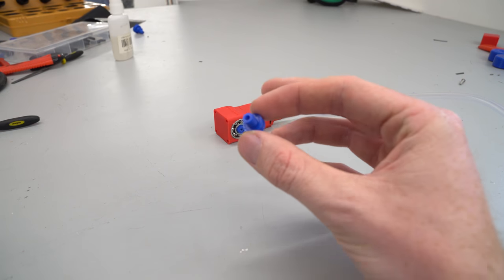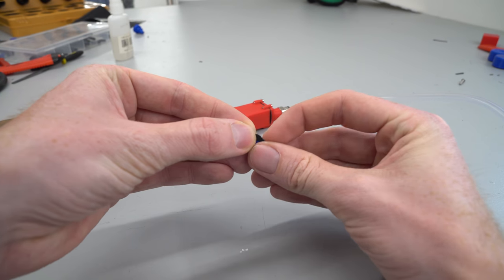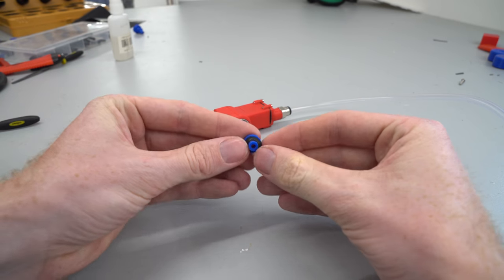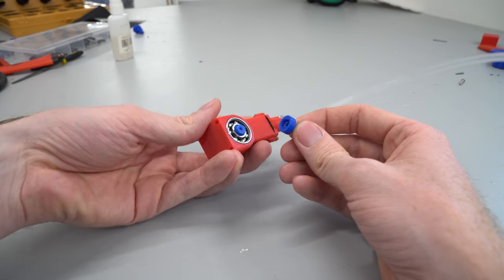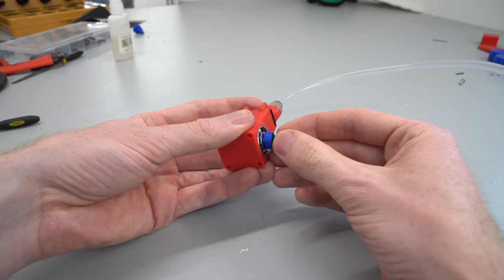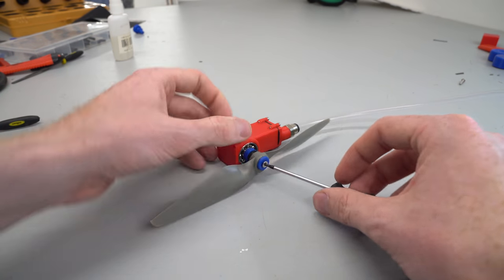The propeller adapter requires a small washer cut from 0.5mm rubber sheet to prevent the propeller from slipping. This is really important because the propeller acts as a flywheel and the engine won't run properly if it slips. Line up the propeller adapter with a notch on the crankshaft and attach the propeller using the propeller washer and an M3 by 20mm bolt.